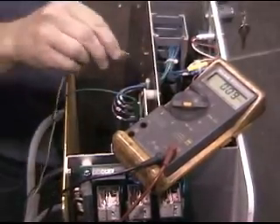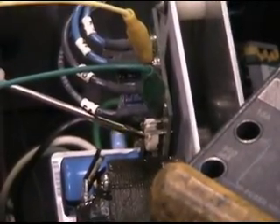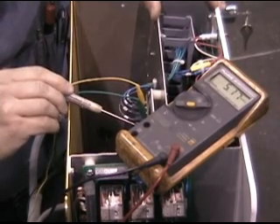Using a voltage meter, attach the clips to connections 47 and 48. Twist the screwdriver until the setting on the meter is not over 5.4 and not under 5.3.